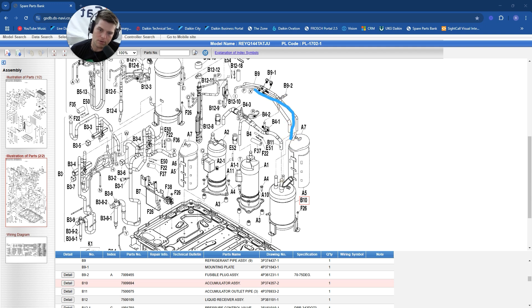Let me draw you a picture. Refrigerant comes into the accumulator and ejects down into the bottom of the tank - follow these jagged lines. This is also where we have the issue where hot gas coming down the suction line - because of the direction it enters - blows down onto a soft plug on the side. If you get hot gas near 158 to 164 degrees, that's where this soft plug actually blows. It's designed to shoot the flow to the left, hit that wall, and dissipate - keeping hot gas away from the outlet.